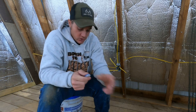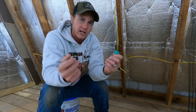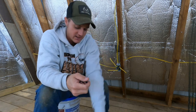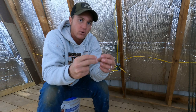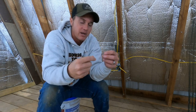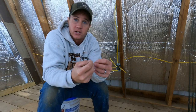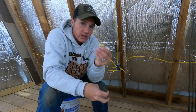Because when you only have a couple wires with the wire nuts, like this here, it's not too bad. You take them together, get them the same length, take some sort of pliers, twist it together, you get a pretty good connection. But from my experience — because I've had several junction boxes when I redid the house, even up in here — there were times I was going to have four or five wires trying to get it all together at one time, then try to twist them and make sure they all actually intertwine really well so you get a good connection, and then put the wire nut on it. To me, that's a bit of a chore, and that's my opinion.